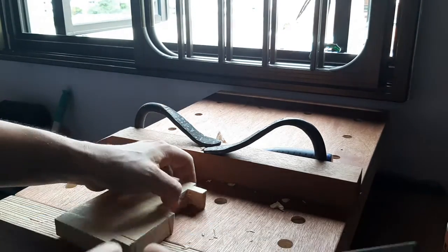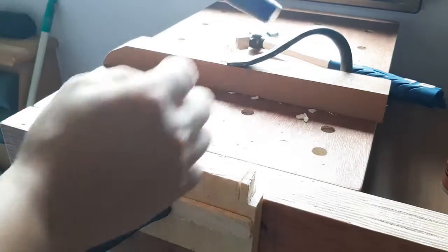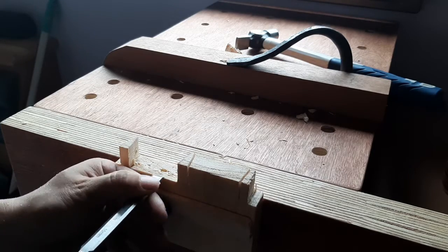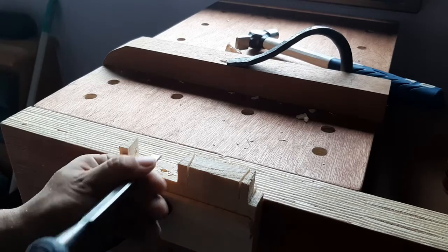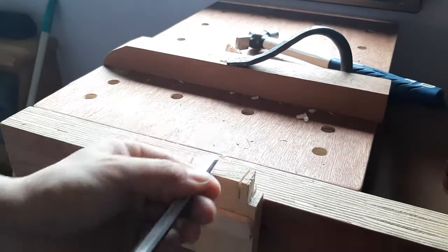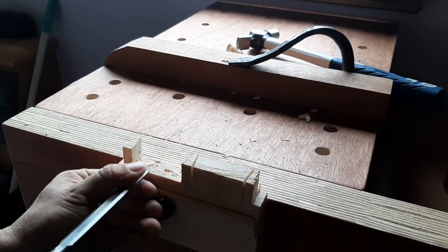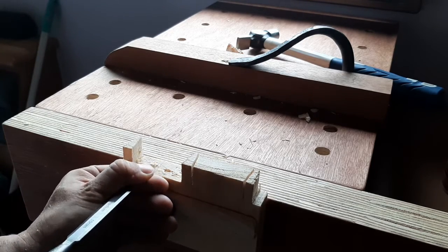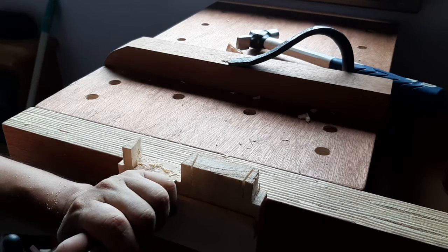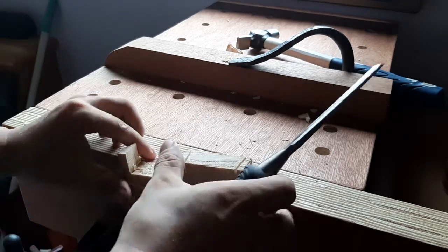So now we can start to pare the other side. So I'll now show you another way to pare. So another way to pare will be this way. Your entrance is kind of flat, so you're just pushing away. So in order to prevent yourself from overshooting, you are using this finger as a brake. Same thing, try and wiggle, a slice. Always easier than pushing straight.